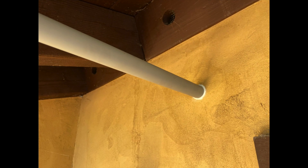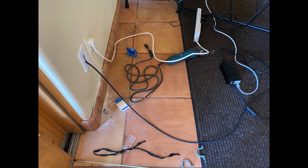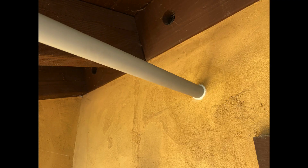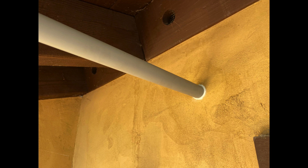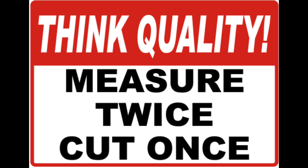The last thing I had to do to get the cable into the house was drill a hole on the outside of the house and cut a hole for an electrical low-voltage box on the inside. The hole on the outside was fairly easy — I had to make sure there were no studs in the way, so I measured that about three times just to double-check, because I definitely didn't want to drill in the wrong spot and have to patch stucco and paint. Always measure twice, three times, or four times to make sure you get it right.